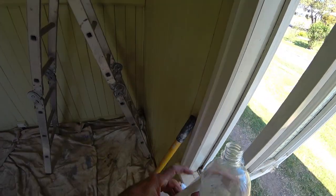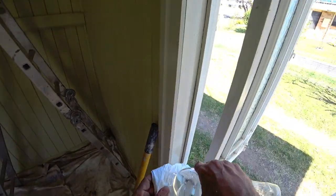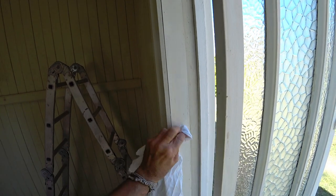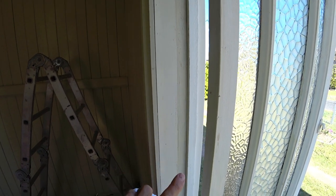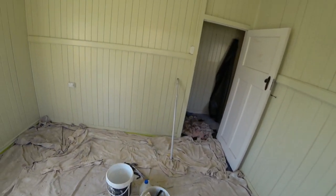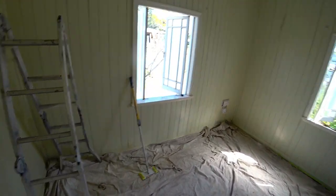Let's check this here. I already know by looking at it, but I'm just showing you. So that is oil-based paint — we need an oil-based primer to go over there. We've got a couple of other rooms we need to check. So we know all this room here is oil-based, and the windows are water-based.